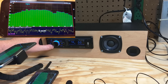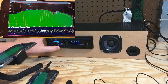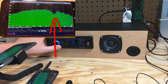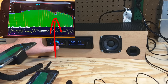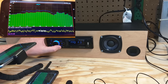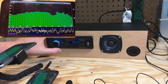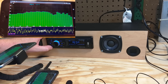I'm using a calibrated microphone plugged into a cell phone and recording with another cell phone to analyze the spectrum. The built-in equalizer didn't show much difference on the spectrum analyzer. Around 2000–3000 hertz there's a dip — that's a side effect of the crossover design, and the crossover software actually predicted that dip. Fading to the front by two on the fader gave me the most even sound across the frequencies this boombox can produce, so the fader really does serve as a useful equalizer.